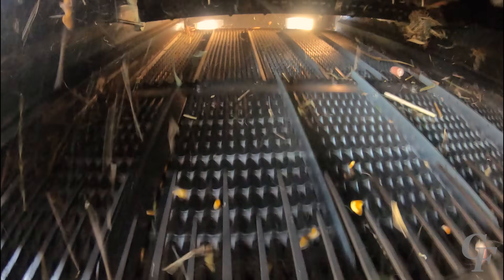After the grain is separated from the crop residue, it falls onto the cleaning system. The cleaning system consists of a shaker pan and screens which are called sieves. The sieves shake back and forth to stratify the grain and the chaff. Because of the shaking action, the grain, which is heavier, will fall to the bottom while the chaff, which is lighter, will rise to the top.